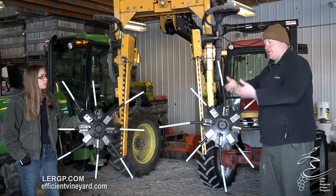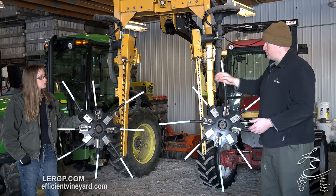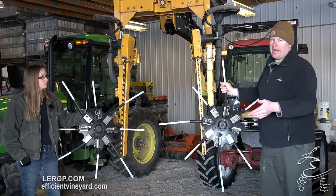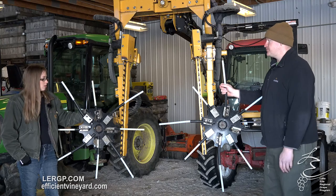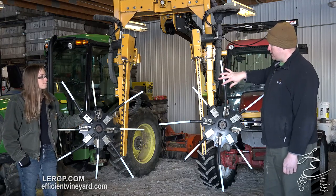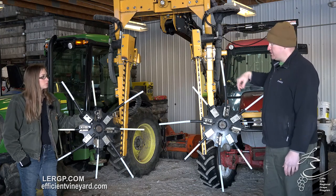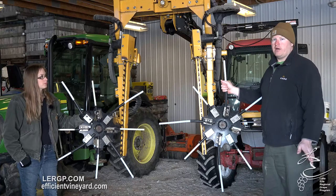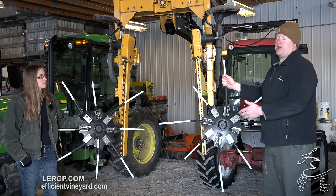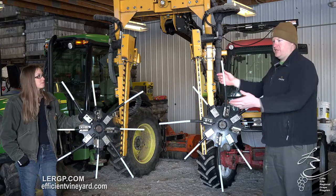It works really well — allows us to get up underneath and pull out the trash. So if you have a vineyard that's been a couple years with very minimal hand follow-up, you can go through with this and it'll pull that dead wood out, rake it off, and give you a very nice manageable vine that you can then come back through and hand follow-up, or you're set up to do shoot thinning. Would you say this particular machine is a more aggressive or more delicate pruner? The way it's set up right now is pretty delicate, yet it has that midpoint of aggressiveness. These are five-eighths rod. I could change all these out to three-quarter inch rod and completely tear a cordon right off. You can make this machine very delicate or super aggressive — you could completely remove a vineyard if you needed to. It all depends on what canopy you need to work through.